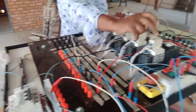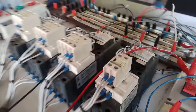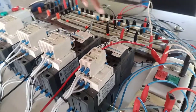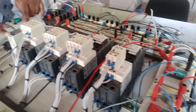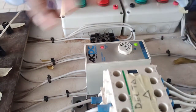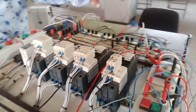We are switching on the breaker. Motor 1 kicked in — you can see the plunger is sucked in. Now you can also see that the timer has kicked in as well. I've used a star-delta timer but it will do what I need. The timer has also kicked in.